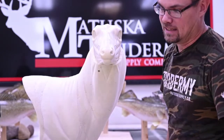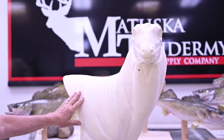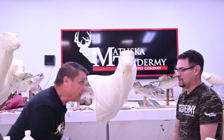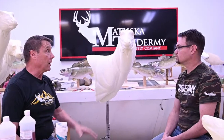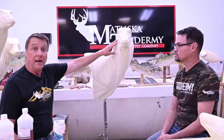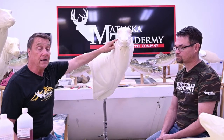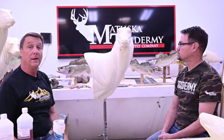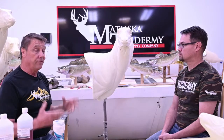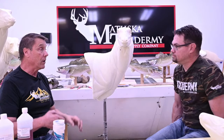Ready for foam? Let's do it. Now, we foam on a daily basis. We foam many times a day, and we've got a lot of different techniques at work. A lot of people use duct tape. You can wrap this entire seam with duct tape, leave yourself a little flap, and pour your foam in there, and then cover the flap. Works really good for filling large areas, somewhat under pressure, which will make a stronger foam.